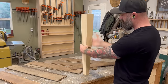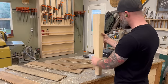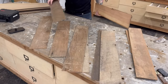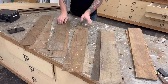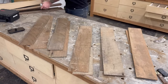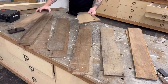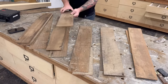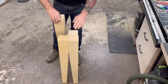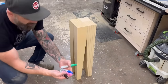The trick now is how to cover these tapered MDF blanks with reclaimed wood in a way that it's not obvious. The main problem was I wasn't able to get all matching boards — they were all a little different. But I had enough matching boards that I could separate out one matching board per pile. So I had four matching boards and divvied them out: four separate piles, one for each leg, each with four random boards that matched across the other piles.